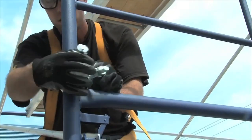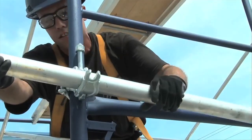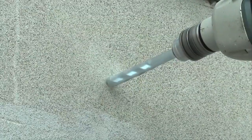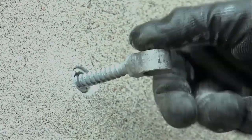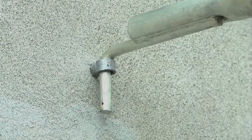The first way to do this is with a wall attachment. The wall attachment must be firmly affixed to the scaffolding, and then you have to select the right type of anchor according to the wall surface that you're working with. For example, on concrete you drill and then install a good anchor before screwing in a hook specially designed by Metal Tech. Then you just have to connect the attachment to the wall. At this stage, take the opportunity to recheck the distance between the wall and scaffolding — this is a simple way to check if the scaffolding is still level.